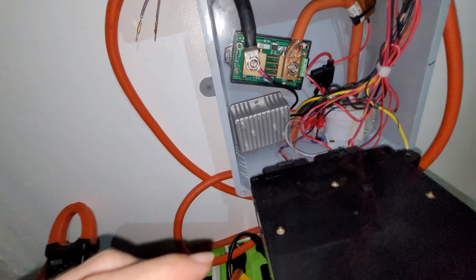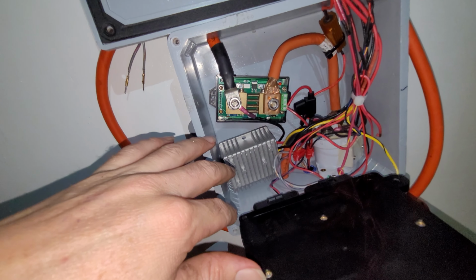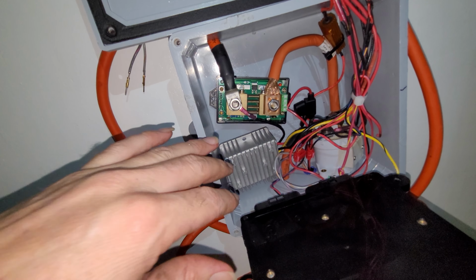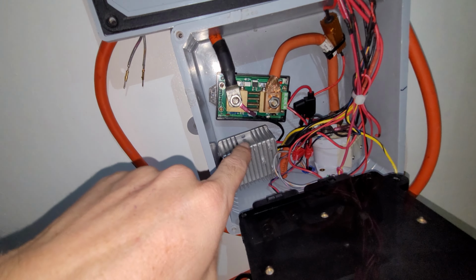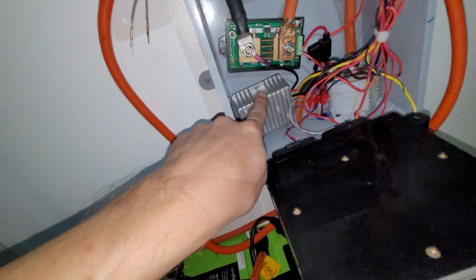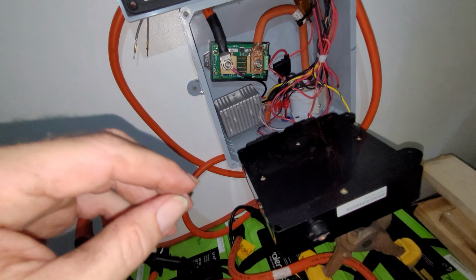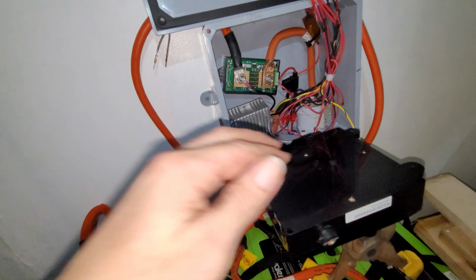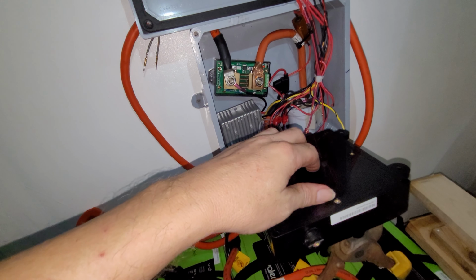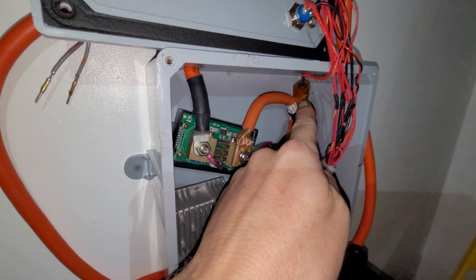And inside here we've got a couple different voltage converters. There's 100 volts going around. Don't ask me why, but there's also a 12 volt converter. This takes the 48 volt battery bank down to 12 volts, and that's what powers the relay. And through the 100 volt converter ultimately powers the computer as well. We've got a pre-charge circuit in here as well.